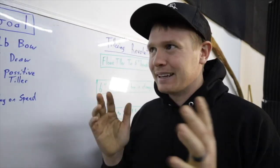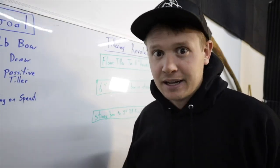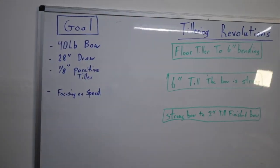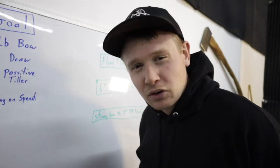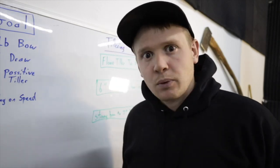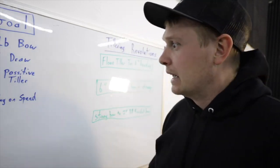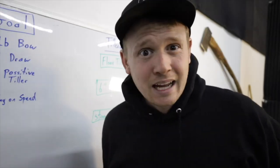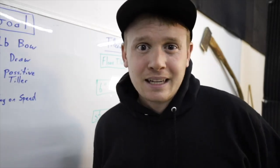So on the whiteboard behind me, I've got some goals and a plan. Let's go into it. I'm gonna walk you through my exact process of tillering and how I go about it. The first thing here is our goal. We've got a 40 pound bow is what we're gonna shoot for at a 28 inch draw. I'm gonna look for one 1/8 inch positive tiller, and that's gonna be the starting point. And then in the end when we shoot it, if that needs adjusted for smoothness of shooting, we will. And then finally, we've got speed. I'm focusing on speed on this bow. We've got thinner limbs. We've got a really, really hard wood in the ipé. This type of bow, I like to focus on speed, and that's how this one's designed.